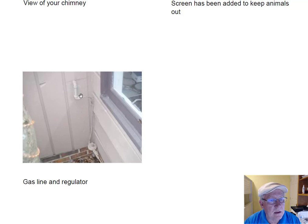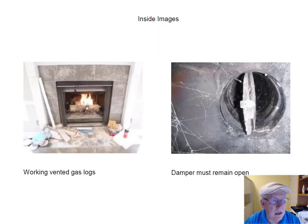We talked about removing the gas line — pretty easy. All of this can be capped off down here, behind the regulator, and all of this can be pulled out. I would patch the outside. On the inside, what you'll find in here are metal panels. This particular fireplace — generally you find refractory cement panels, just like you have in the back wall and on the floor — but this one is metal.